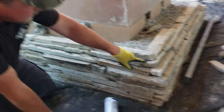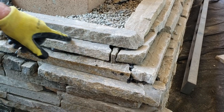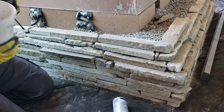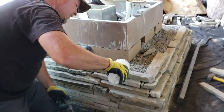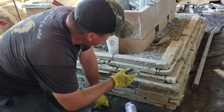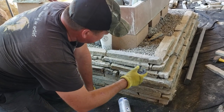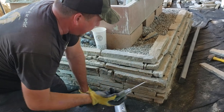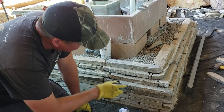Now if you look right here — zoom right over here — we've got some foam sticking out. We don't want that. So I filled up an old cup from yesterday's lunch and I'm just going to sprinkle a little bit of sand on top of that, take the head of my screwdriver, and just pull that out. By doing that it stops the expansion of the foam and keeps it from traveling out underneath there. We definitely do not want that problem — see how much cleanup there is if you don't.